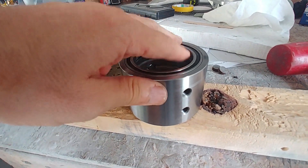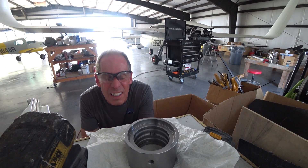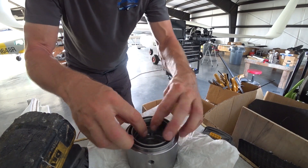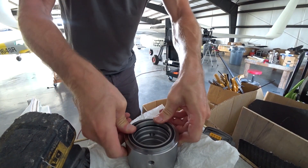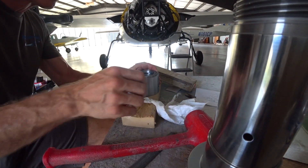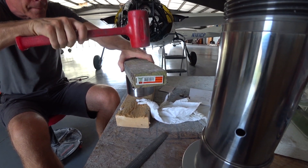It's fitting nicely in there just as it's supposed to — that one is a press fit. On the other side I tried the same thing, getting it out quickly, wiping it off and dropping it in. That one went a little bit further than the other but the collar wasn't hot enough and the bearing wasn't cold enough. Either way it didn't take much with the two-by-four — it was already fairly straight, just a couple of light taps and it went in without too many problems.